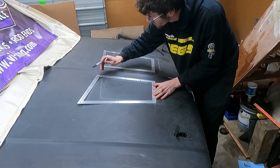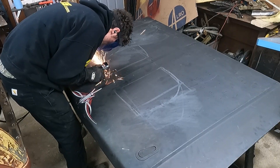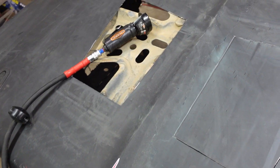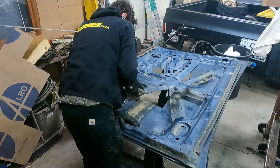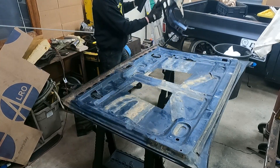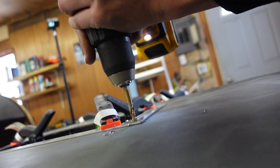I made this weird polygon shape that I think might look pretty good, and that's what we're going to go with. I placed them on the hood so they lined up with the ducting, traced them out, and then went to town with the grinder. While I'm cutting, I'm going an eighth inch on the outside of the line so that the hole in the hood is a little bit bigger than the hole on the inside of the flange. With the holes cut, I clamped down the flanges and drilled all the holes for the hardware.